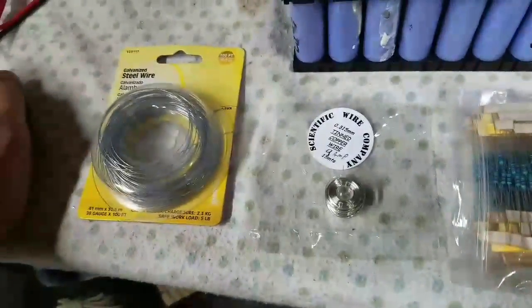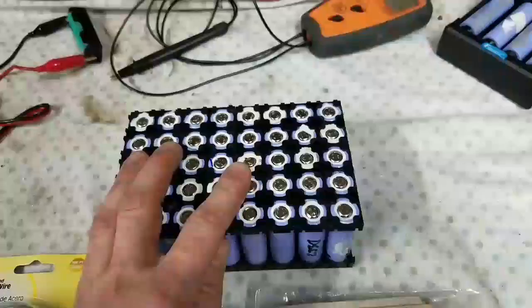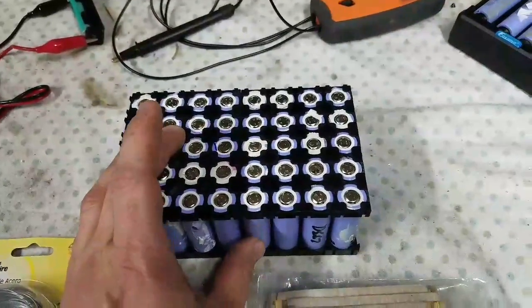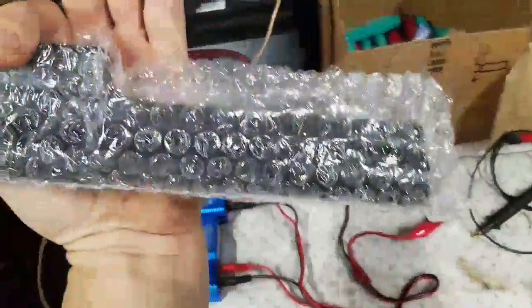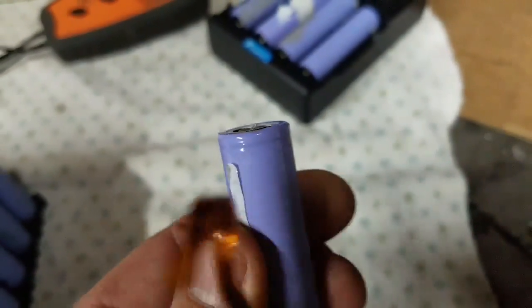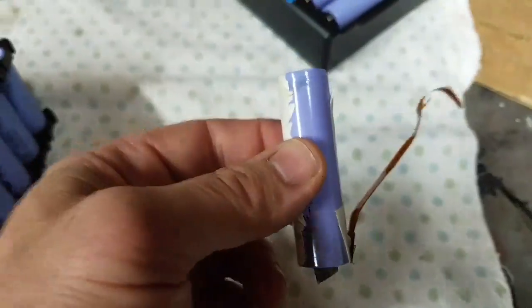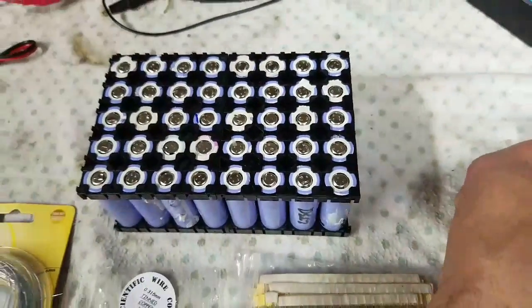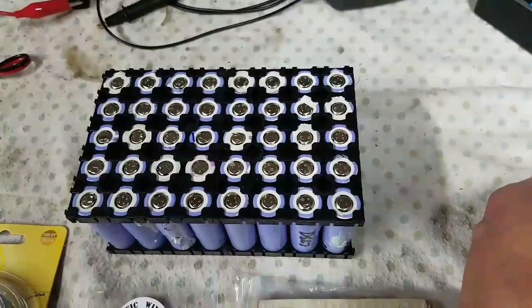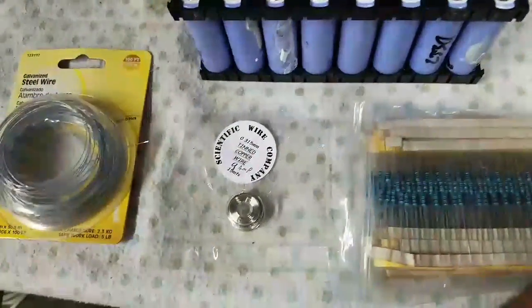It's a very light car. I want to talk to you today about fusing these battery packs. We need to fuse them because one of these cells could short. I know that because when I've been pulling them apart — these batteries out of computers — some of them are at zero volts and you can see there's some corrosion. Out of 100 batteries, there's maybe one or two. But still, if you're driving around and one of these shorts out and you don't have a fuse on it, these things could go up in flames. So you really need to protect yourself, your project, your money, your investment, your time, by just fusing these cells.